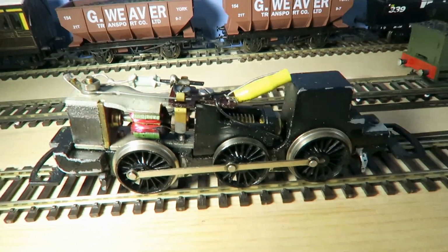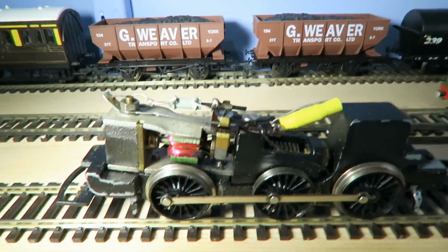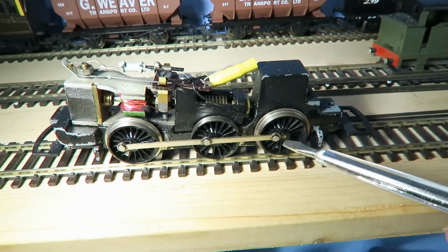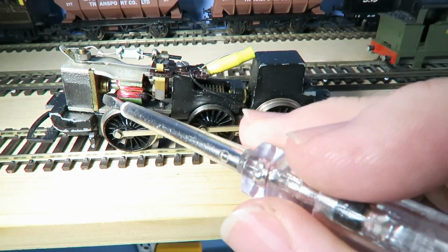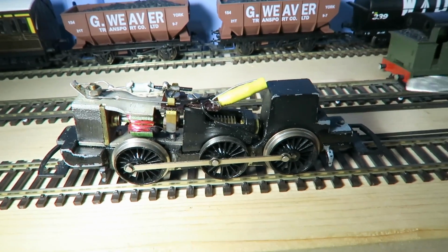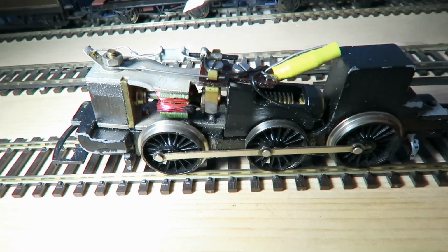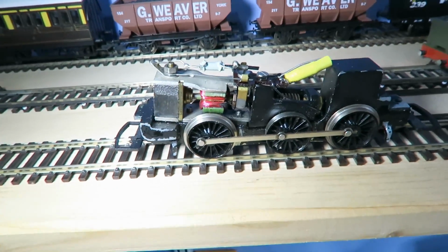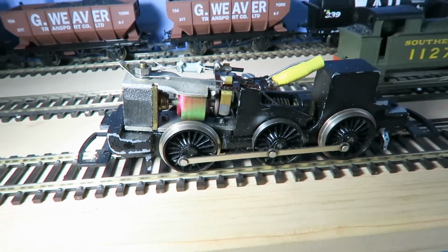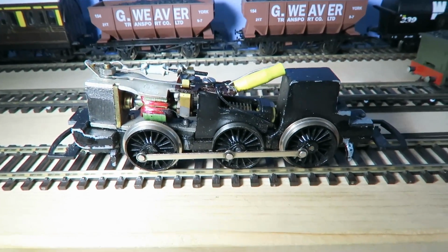Wow, what a good old mechanism we've got in here then. So a motor not unlike the Hornby X04, but obviously different. We've clearly got the bearings down this end and that end. I don't know if there'll be a ball bearing in there. Magnet actually feels quite healthy. We've got the suppression system, very old capacitor there. Let's just have a look at it flicking over. There's a lot of dirt and dust. She's just come out of store, so not a lot's been done to her.